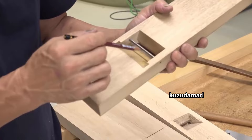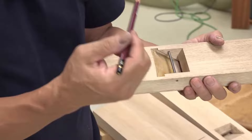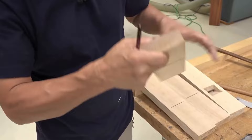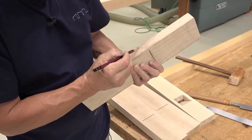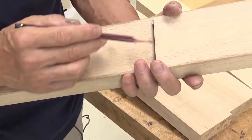This area is called a kazudamari, where the plane shavings collect. It doesn't matter if it's further back or forward, so long as the plane shavings come out neatly. In store-bought products, the kazudamari slants back from this point. The crucial area is around the mouth. In this plane, it's at a right angle and sturdy. In store-bought products, it angles back and becomes very thin and flimsy — even though this is a crucial area that should be sturdy and stable. This is why I've made it a little narrower.